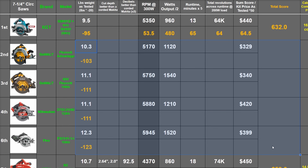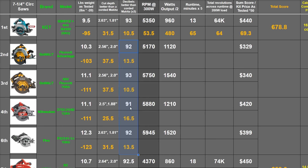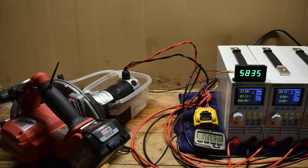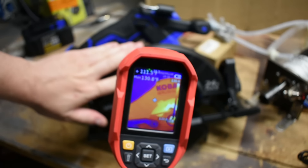So here's how things look. Tools start off with a deficit in the form of weight, then claw that back with points from various testing and performance. We add cut depth at 90 and 45 degrees — each of the DeWalts excel in this crowd, though Hilti takes that spec overall. Points are awarded the deeper they can cut at those angles. Then for noise: 91 to 93 decibels at one meter. Not a lot of difference between these, and it won't make or break any saw buying decision, but it's interesting when some are whisper-like. Last stat to tally: runtime and amount of work done on that battery's runtime. We generally strap on an 8 amp hour battery or equivalent and see how long each saw can run under a 200 watt load — something basically no brand will tell you, yet some tools do this much better than others, and some inefficiently turn a lot of that juice into heat.